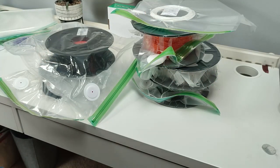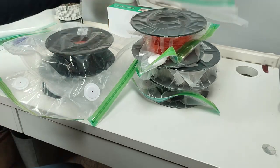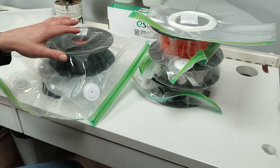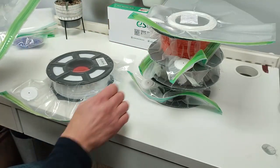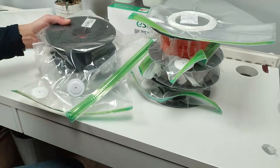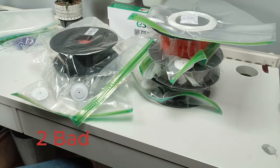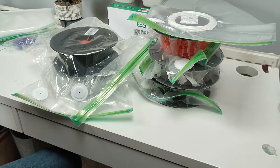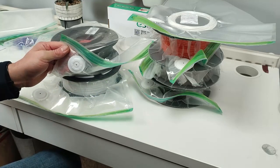A very quick update 12 hours after vacuum sealing the bags: we have four which have sealed fine and kept their vacuum, one which has terribly not sealed, and one which has partially lost its vacuum. So not ideal — a 33% failure rate. But overall, not bad for keeping your filament dry. Not the best option; maybe the seals could do with a little bit of work, but overall decent.